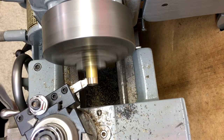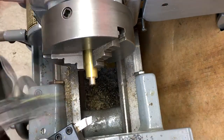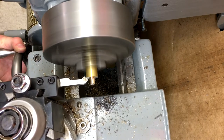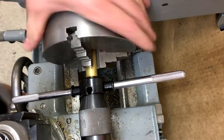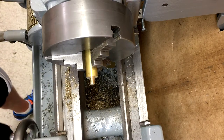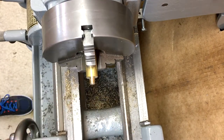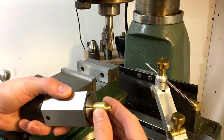The last part of the hinge system is the lower part which will thread into a spare magnetic base. This way I can quickly reposition the light or move it from one machine to another. I turned down a short section of the brass to five-sixteenths and then threaded it with the die. Then it was back over to the mill where I used a hex collet block to turn a hex on my part so I can tighten it into the mag base.